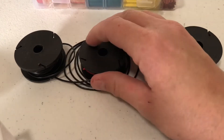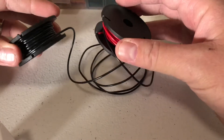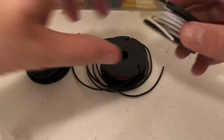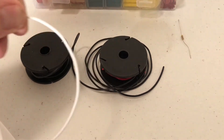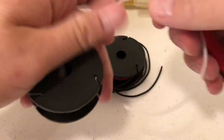I recommend you have three different colored wires. The switch wire is non-directional, so you can use the same wire on both. Because the LED is directional, I like to have two different colors — preferably red for hot, black for ground — so I don't get the wires backwards. First we're going to wire up the switch. Go ahead and pull off some wire — you can always cut it shorter afterwards but you can't add wire to it very easily, so give yourself a little extra slack.